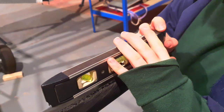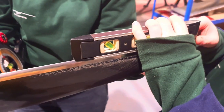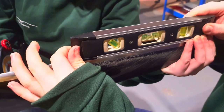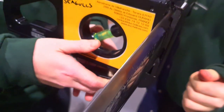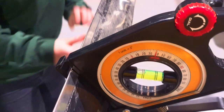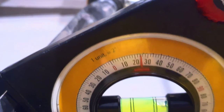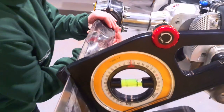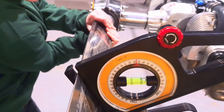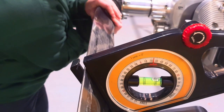Again, we're going to use our 25 centimetres from the tip and get that blade horizontal. We need this blade horizontal so that we get a good reference, and of course we can't touch the other blade. Once that is absolutely level, Carys is going to come in and fit the pitch setter. If we stop for a second we'll see a little problem — the pitch has got knocked between operations. We need to make sure that goes back to 24 degrees. Make sure that you check that pitch; don't just look at the bubble.